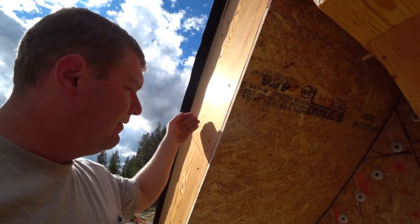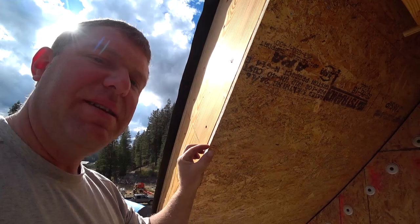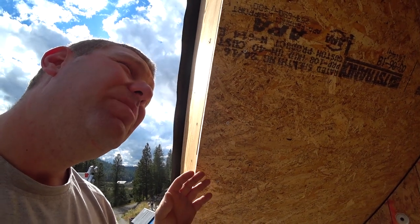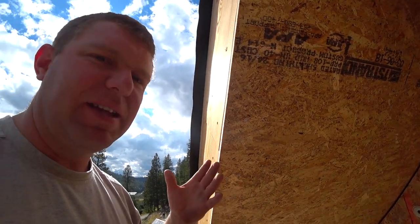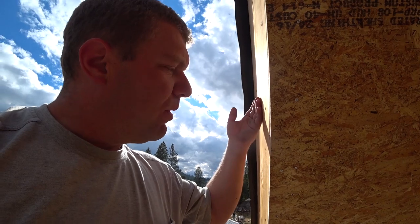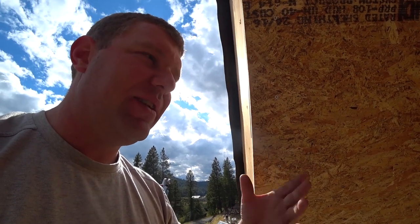One of the challenges with this is that the fascia metal cladding comes down, but it needs to be furred out under the eave here. I'm thinking 3/4 inch, because we want to clad the underside of the rakes and the eaves with something like cedar or a beautiful pine. So we want this fascia board to come down and overlap that to protect the end of those boards and also to have a finished look to it.